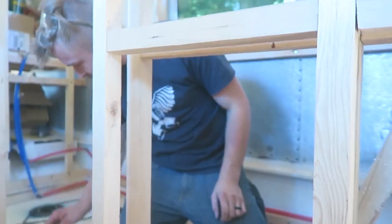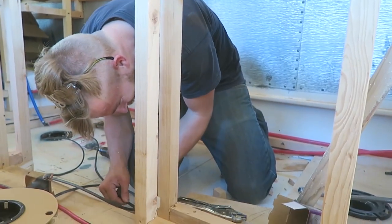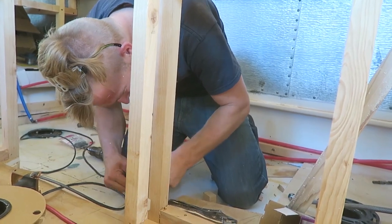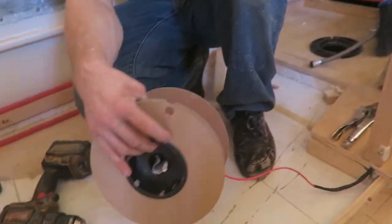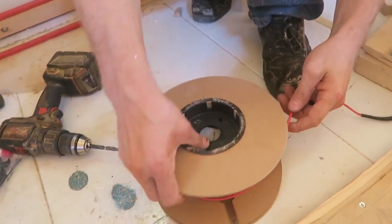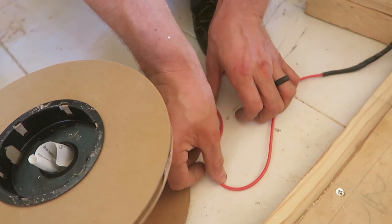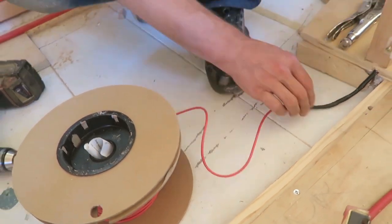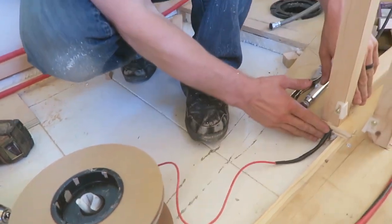Because our shower is going to have electrical floor heat, I need to run this wire so that it gets into the shower. We're going to bury all this wire in our second layer of deck mud, and it's going to be about three inches apart, wrapping all around in the shower. That way when we're hooked up to shore power, we can turn the thermostat on and the bathroom will warm up - this will all be under tile.